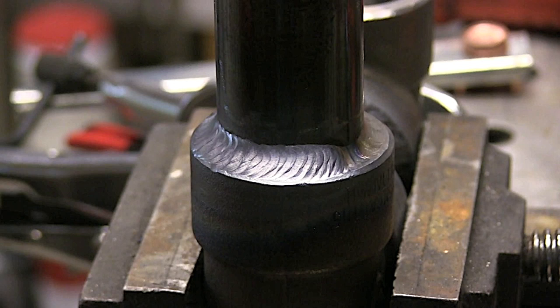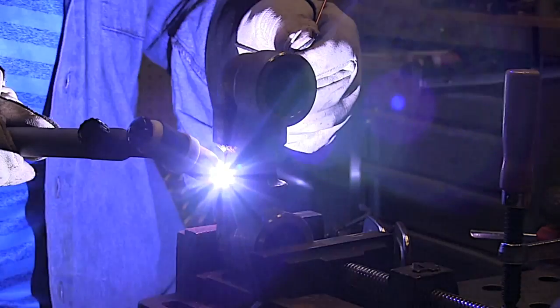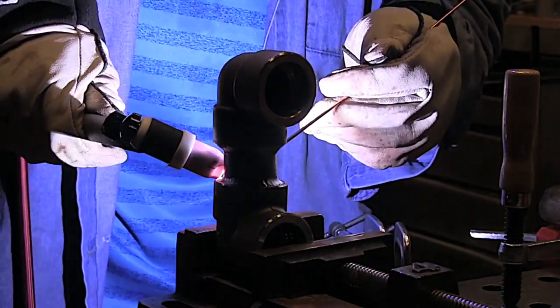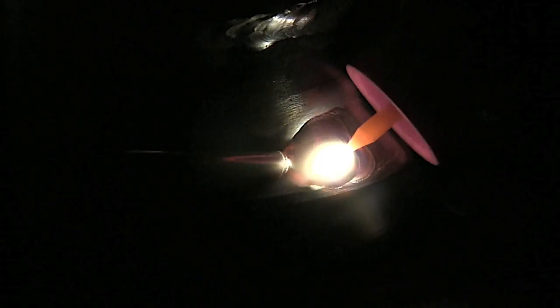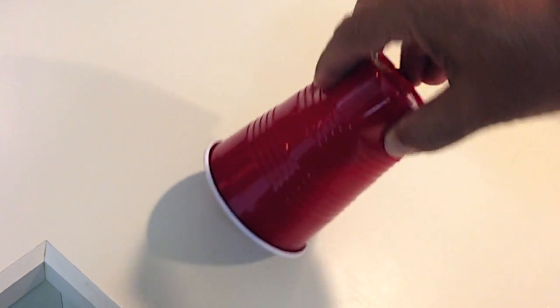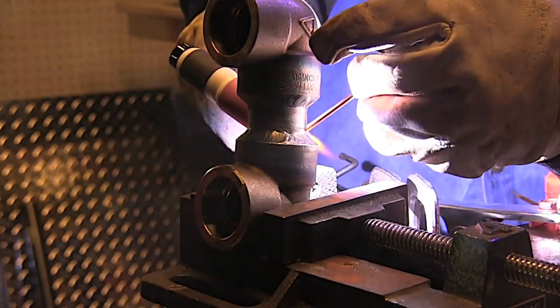Let's do a little recap. For the first pass I'm using 3/32nd filler wire with a slight wiggle — just enough to keep the torch moving without a very wide weave, keeping the heat directed down to the root of the joint where it needs to be. For the second pass we go a little wider — using the full-size gas lens cup — akin to walking a 55-gallon drum across the shop floor. It's not really wiggling now because I have weld there; I'm actually walking it. Hopefully that makes the whole concept of walking the cup gel for someone who isn't quite grasping it.